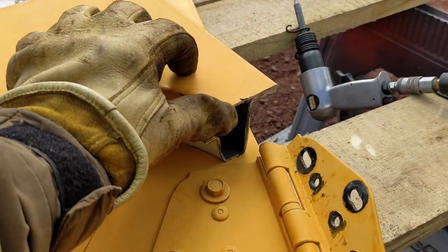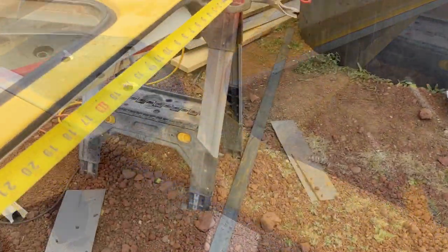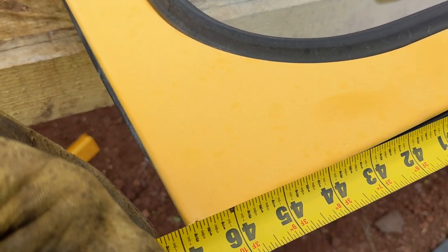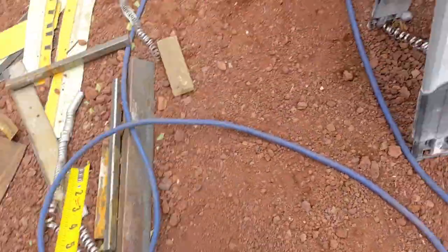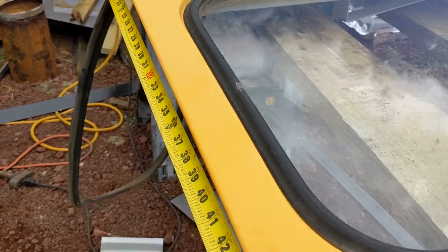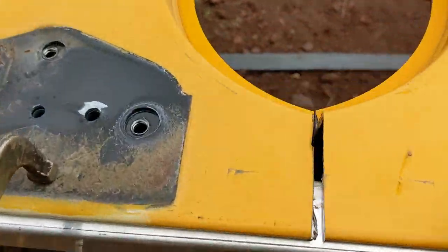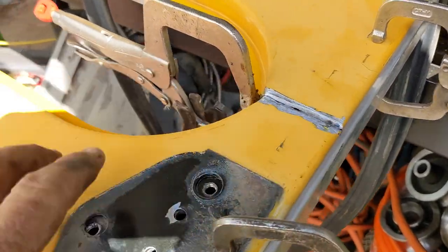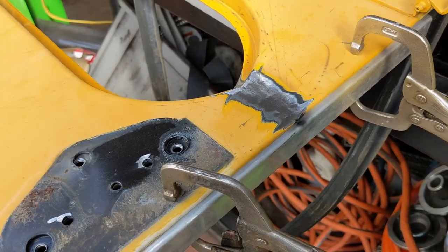I've got this cut off at the bottom and it leaves a pretty clean edge. Now I've just got one more cut to make up here, then I'm ready to clamp everything together. I've got some lengths of aluminum square tube which are really straight and will also absorb some heat during welding. I'm just under 47 inches on this side. Doing my one-handed tape measure technique, I measure the other side — they're not quite the same, so I've got to shorten that side a little over an eighth of an inch. After the adjustment they are even, so I've moved this over to the plasma cutting pod and chamfered these edges so I can get a good bond and solid structure when I weld.